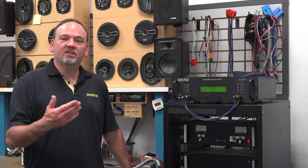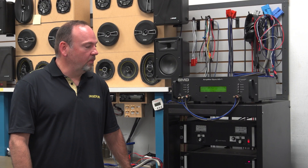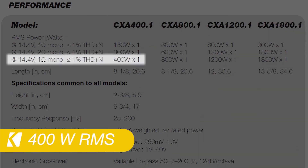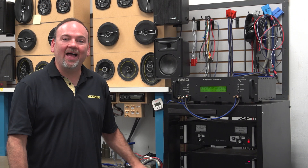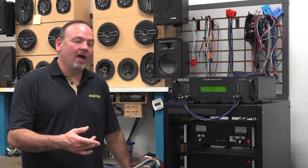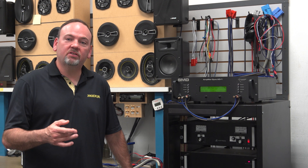The sound of the relays lets us know the test is over. Here we are — the little amplifier we call our CXA 400.1, rated at 400 watts into 14.4 volts, just developed 514 watts into one ohm. Now we're going to back out and do a dynamic burst test into one ohm at 14.4 volts.